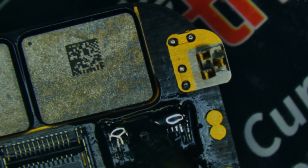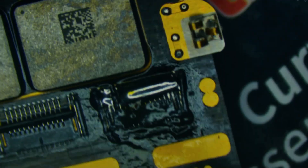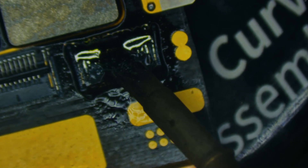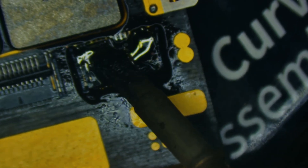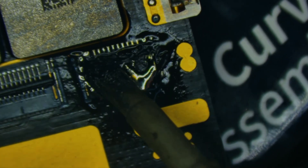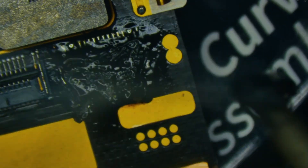Got my soldering iron at 320 degrees Celsius, and we'll bump it up to 400 degrees. This way I'll be able to quickly melt through the plastic, moving the pins around, completely splitting them from the board. Pushing the ground pins out of the way on both sides and sliding the whole melted mess away.